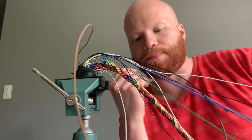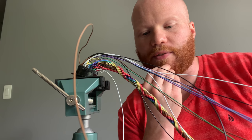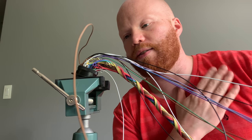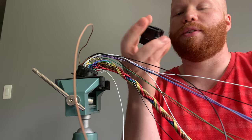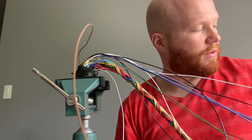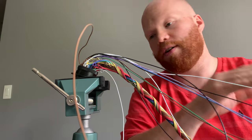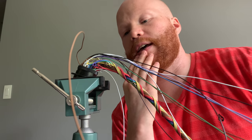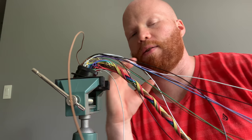Not really sure if that's technically the best way to do it. It's difficult when you're starting out with these things because there's just not a whole lot of information. I know that generally they say to separate ignition leads from sensors and all that kind of stuff, but it's not really possible when you're taking the ECU connector, which is 34 pin, I believe, and translating it into a 61 pin and a 29 pin. It's not really possible to divide them up where this connector goes to this thing and the other connector goes to the other one. You can't really do it. So I'm not really sure if this is the most ideal way to do it, if I should have had more firewall connectors. I mean, that doesn't really make a whole lot of sense to me. I feel like a lot of cars only have one even.